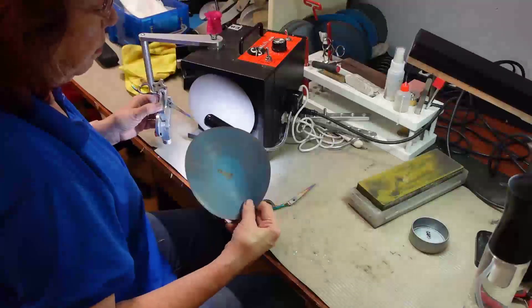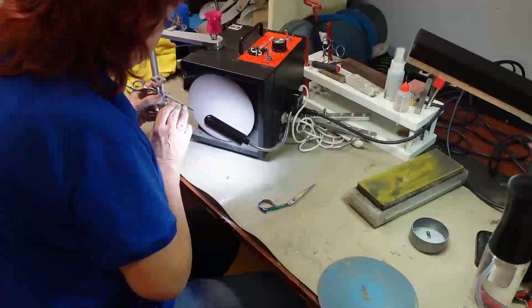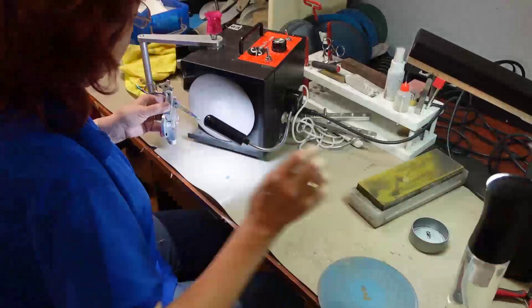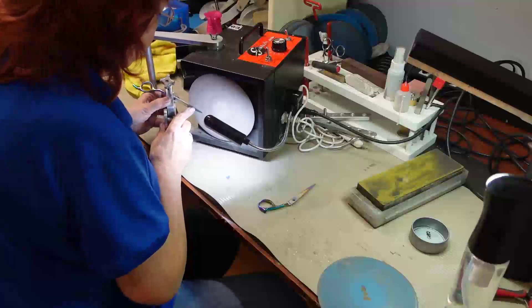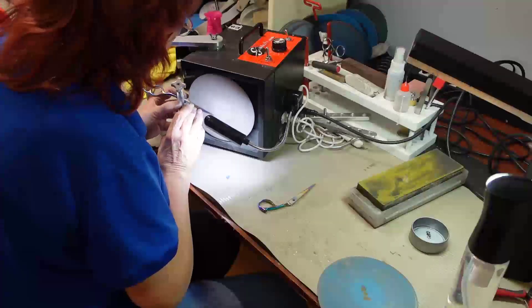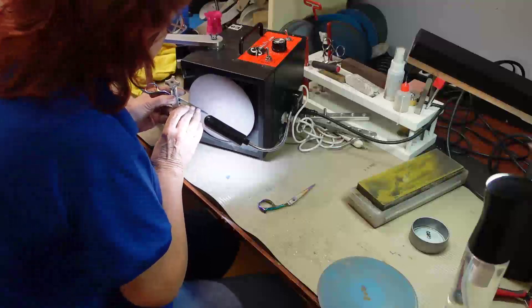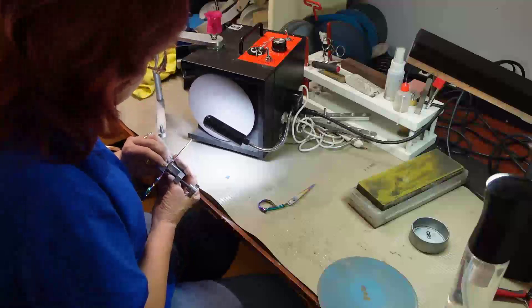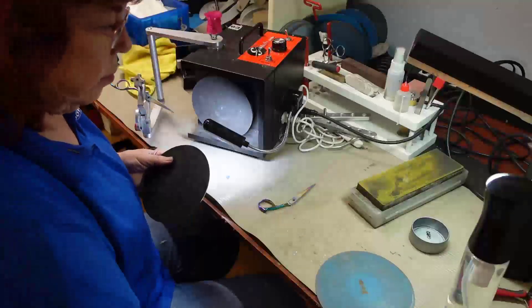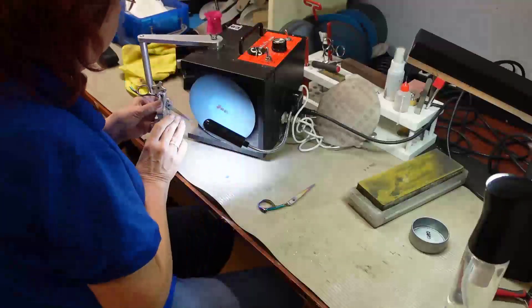This is a 60 micron — the previous one was 800 grit. They're kind of similar but the micron seems to be a little more aggressive. Almost there, and it's getting warm — you don't want to overheat the tip. Almost at the tip, but if I lift up too much to get that tip I've just accentuated the problem, so I'm working kind of behind it. That's got it — I can tell. These little cheap scissors usually are harder and take more time, especially when you're going behind somebody else's sharpening.